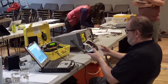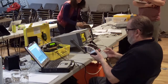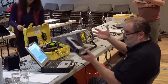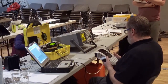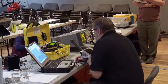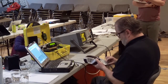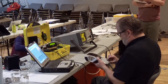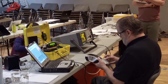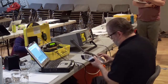Ed, you wanted to keep a record of this. Yes, tell me what it is you want recorded. I've got a pen and piece of paper. Well, Steve had changed his from what it was, but just for argument's sake, it was 0.83 kilohertz of deviation. 0.83. Yes, and his radio is an ICOM IC2720. IC2720. And we had that at 142.